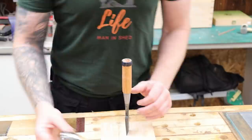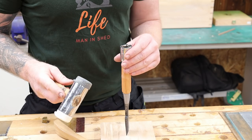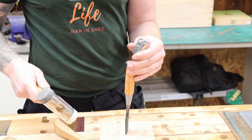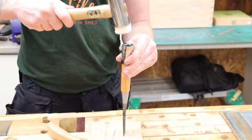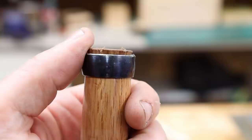Getting in a bit closer — I'm using the socket to drive the hoop down. These can be kind of hard to drive so they do take a bit of a whack. The socket is wider than the handle and just catching the hoop. Keep checking as you go. I'm actually breaking through the hardwood underneath — this is why you don't want to sharpen your chisel first before doing this. Set your hoop, then sharpen your chisel.